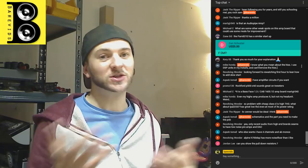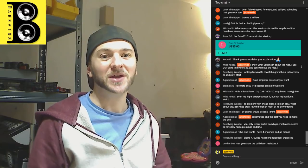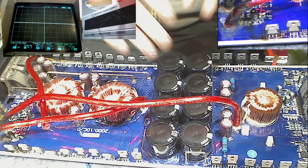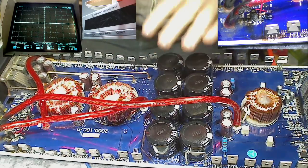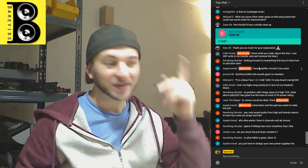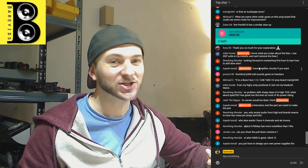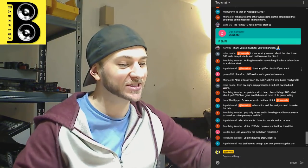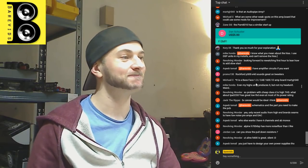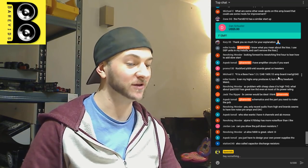It can just go from 0 to 100 straight away because it's got a high resistance on the output of the power supply. So that made sense. This circuit design worked better before they applied pull down resistors to the rail capacitors here. And when they applied the pull down resistors, they didn't stop to think, oh, hang on a minute, maybe we should add a soft start to the power supply section now that we've added pull down resistors, because now every time the amplifier powers up, the power supply is going to be presented with a short circuit for a brief moment until the capacitors charge. They didn't think that. So that's why we have this problem with the V3 and V4 boards.